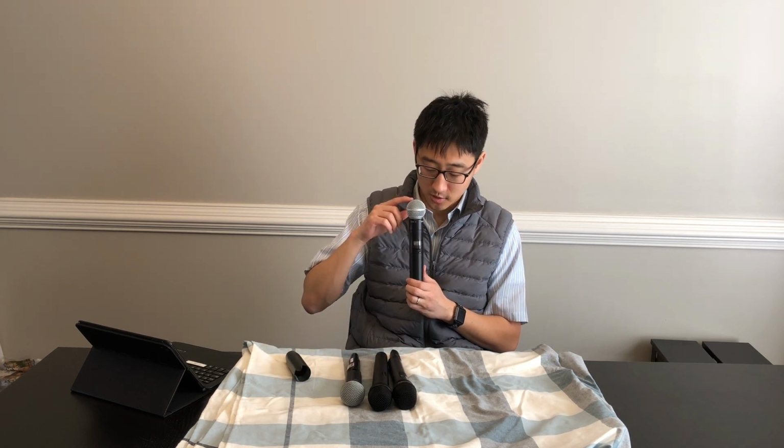And this one does not automatically scan the entire band and try to hop frequencies and figure it out. With a SHURE Axient Digital type system, like the AXT600, you can set it up to automatically hop or change frequencies if interference is detected, but the QLXD system and the ULXD system do not do that. So the benefit to the 2.4 gigahertz systems, like I said, is that they'll always scan and change, unlike a system not in the 2.4 gigahertz digital range.